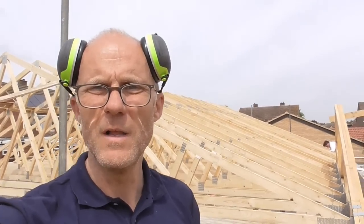So hopefully you'll see from that bit of time lapse that we've got those trusses up. They are quite wide — 12 metre span, which is big — but they've not got a great pitch on them. The pitch is only sort of 25, 28 degrees. So they sort of look more unwieldy than they are. We just took our time, one on each end, lifting them up, and it went really well. You'll see what I've done here is this little girder — we put that in first, and that's just propped off the scaffold up there.